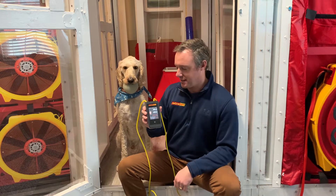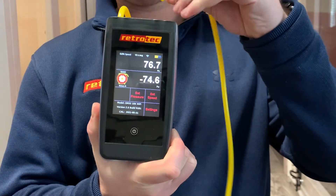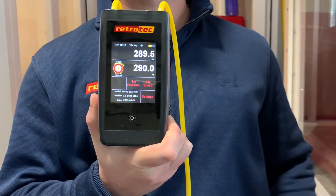So this looks to be cooperating. Since I'm still in blue on channel A, I'll just move channel B over to green and look for the exact same thing. I want to make sure those are going to read within one percent, and these are reading right on the money.